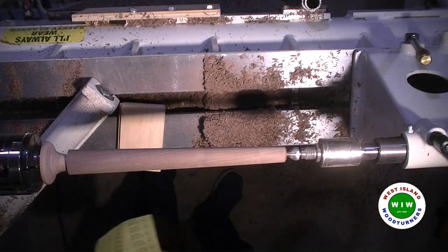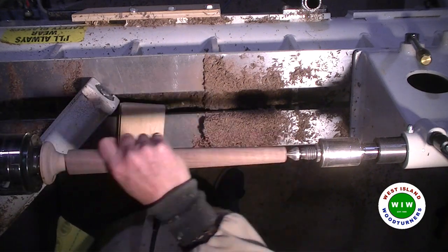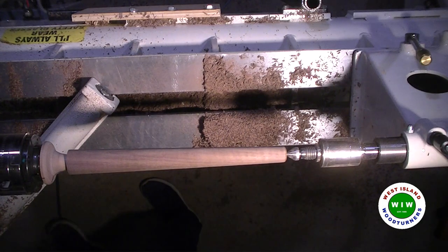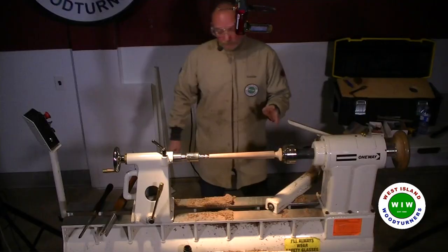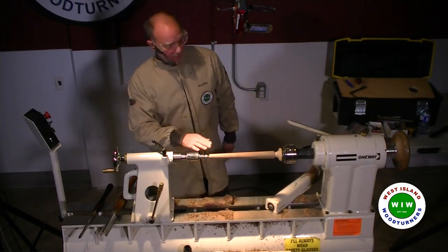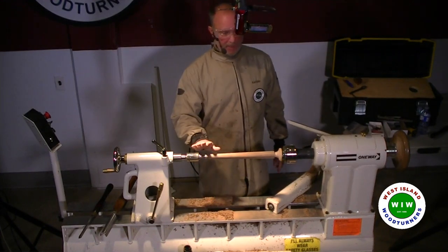Of course, when I'm in my shop, I will use compressed air between grits to blow anything out, so you don't have any weird grits stuck in the wood anymore. So we'll pretend that I actually sanded through all the grits. I mean, so that was 120. I'll go 120, 180, 240, and I stop there.